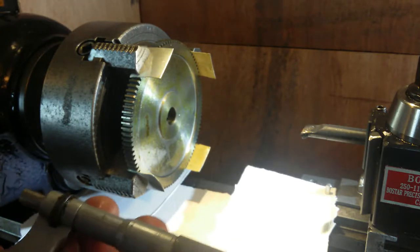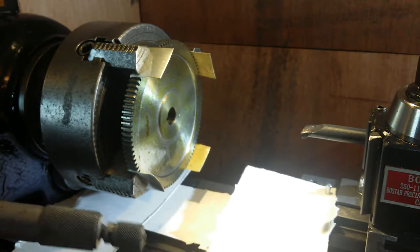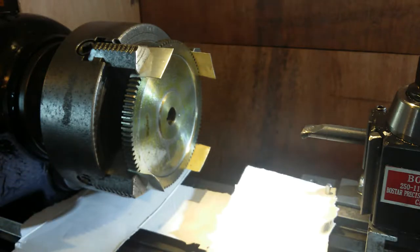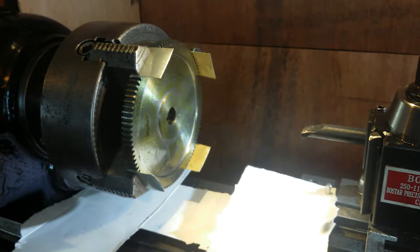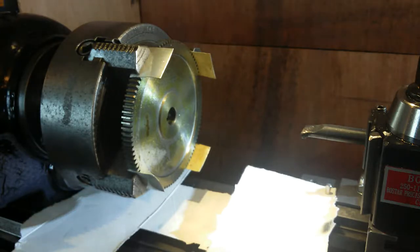So that time I got 625 and 6, I think, something like that. Yeah, 625 and 6. So I'd say that's a 625 hole. And I'm within 6-7 tenths of measuring it in two measurements, so I'm quite happy that's the right measurement.